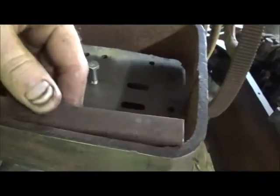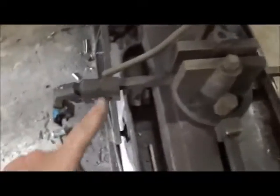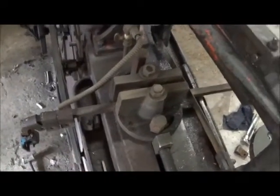I'm working on cutting the pieces to go in here — I think this is five-eighths actually; I didn't have any half inch. What we've got here is an old mud flap arm. Some of these you've got to watch because they're rounded on the ends and spring loaded — I don't know if the whole thing is spring steel or if they're just heat-treated at the spring part. But this one here is actually soft steel, so I'm cutting it to length now.